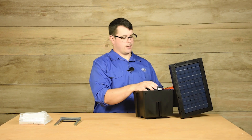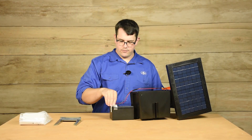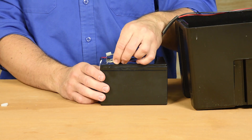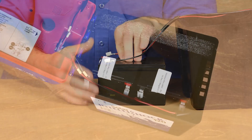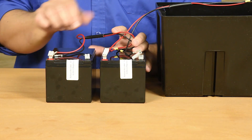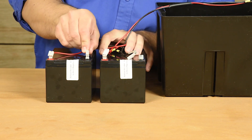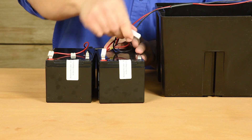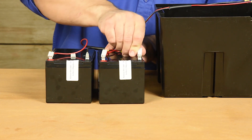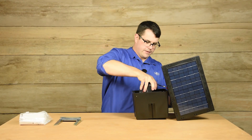So we need to connect our battery. To do that, remove this piece of tape. Slide the negative lead over the negative terminal and replace the plastic cap. Unlike the 30 and the 60 units, the Solar IntelliShock 120 has two batteries, so connect the negative terminal to the negative lead on each battery. Replace the battery back in the energizer.